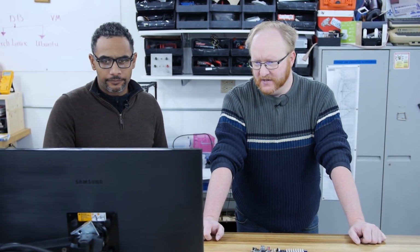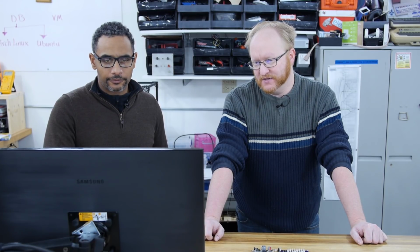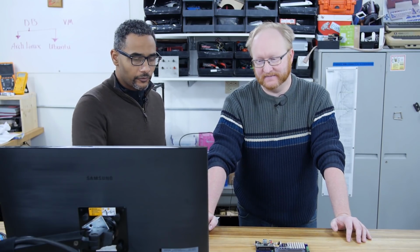Yes. So the big changes were to the power circuitry and then some bodges on the screen. That was a major change right there. So the screen threw us for a loop. But now, switching regulators basically switch on and off very rapidly to create lower voltages, which means they're very efficient, which means you're not wasting voltage potential as heat. Right.